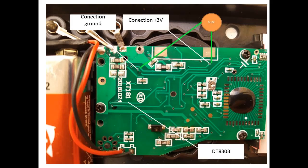Your circuit board may differ a little from this one for the same DT830B equipment, because each circuit board has a number on it and it may differ from yours. What you have to do is find the points where, when you select diode mode, these two points should show three volts. They show zero volts when the probes are not touching, and three volts when the probes touch. Connect these points and run a battery of tests to confirm they are the correct ones — not a false match from another source unrelated to the diode test mode continuity function. So be careful.